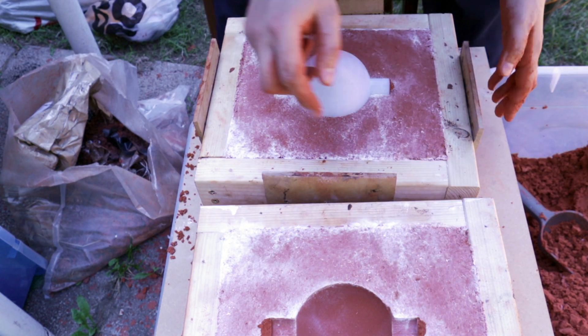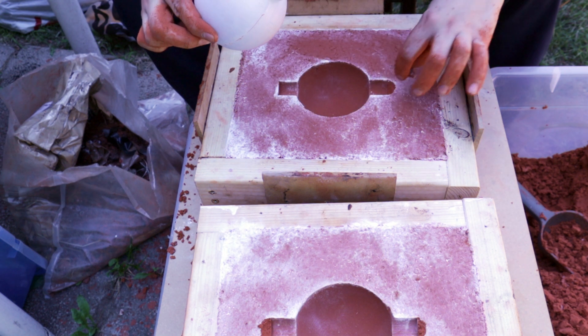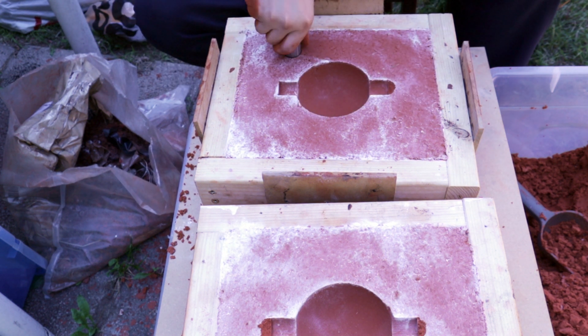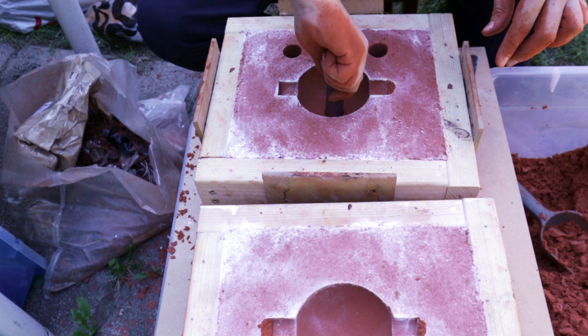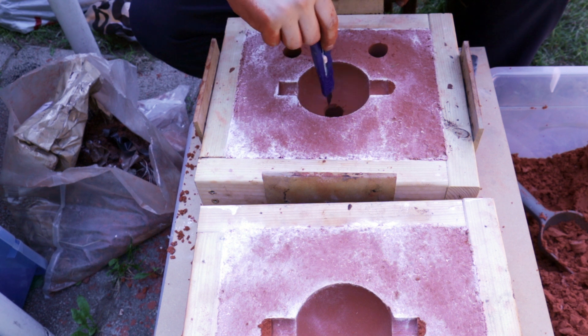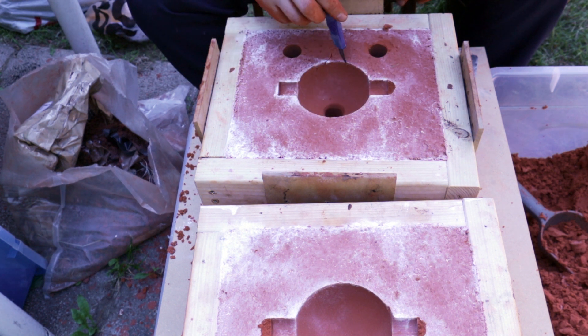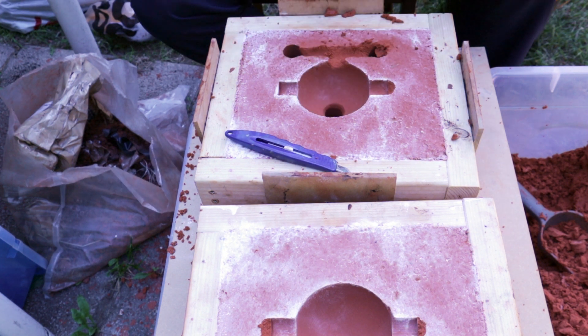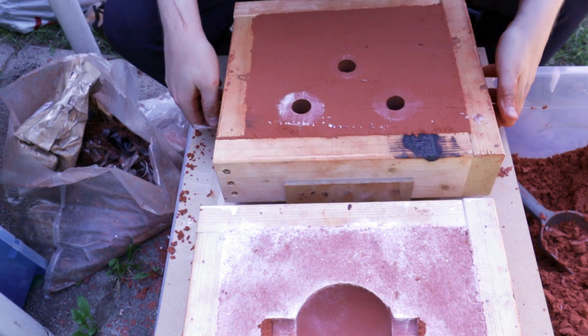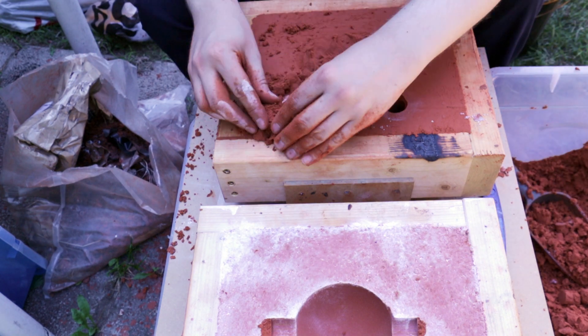When cutting the gates I wanted the metal to flow past the part, hopefully pushing any loose sand and crap with it. The less turbulent and bubbly metal hopefully then overflows at 90 degrees into the part. I also added a riser on the part itself, as the top of the ball shrank in my last casting attempt. When cutting into the pattern I tried smoothing off the transitions, as these seemed to be areas prone to shrinkage casting defects.